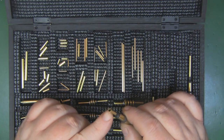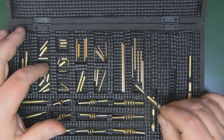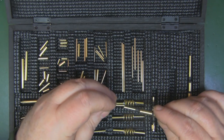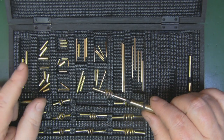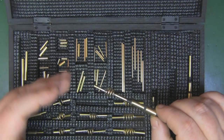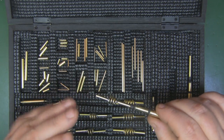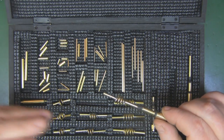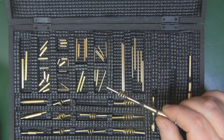And here on the driven element you've got a tube here, and you can place in these different diameter tubes to make the driven element longer, or you can add some of these loading coils here, place those in the top like so, and you can build up different dipole antennas and experiment with the measurements and the different configurations to get a decent working dipole antenna that possibly as a design you never really thought of before. So it gives you that flexibility to prototype your different ideas, and if you're like me, some of them will work, some of them won't work.